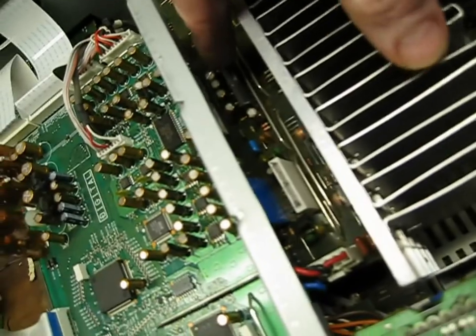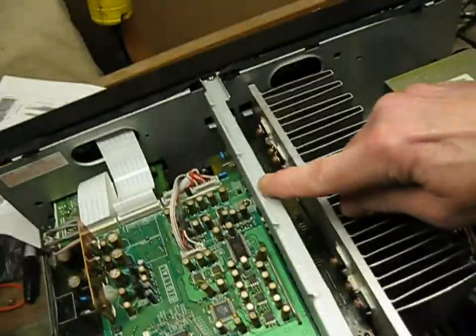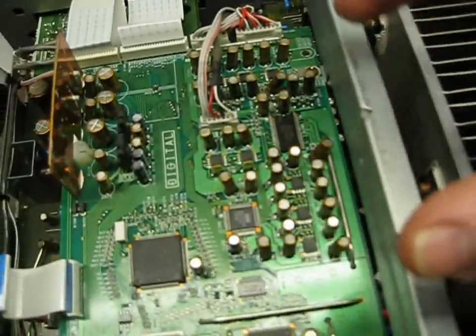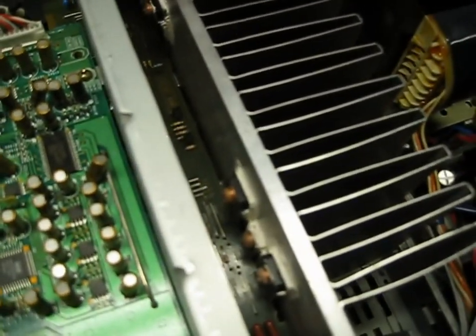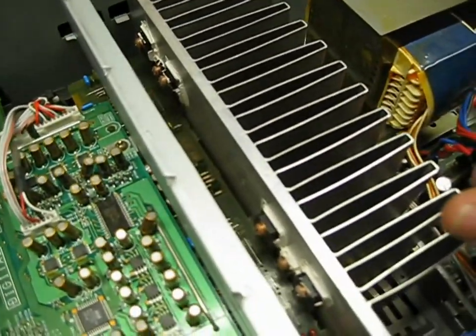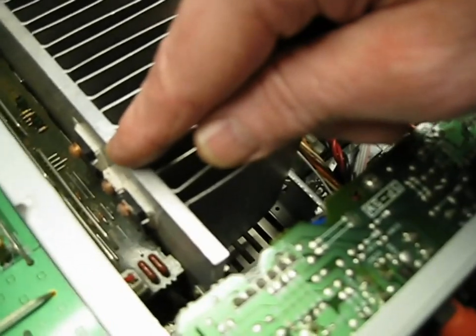To re-solder that amplifier chip I've got to remove this board, get it out of the way, remove this center brace, and then that board. That entails taking all these screws out along here that hold the back of this board, screws inside here, there's a plastic standoff, there's a clip up top on this side you've got to squeeze, undo the connectors, lift this board out, take out the center brace, and then the lower board has two screws. Also the amplifier ICs are screwed to the heat sink — you've got to unscrew all of them, undo two connectors, and then that whole board will lift out.